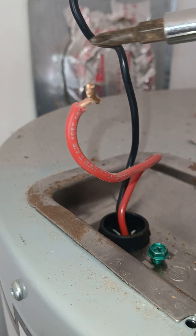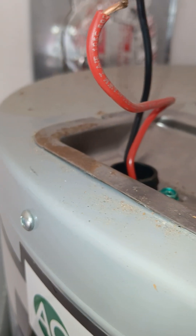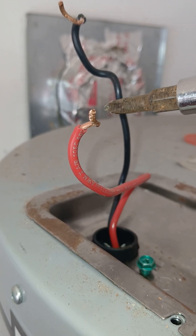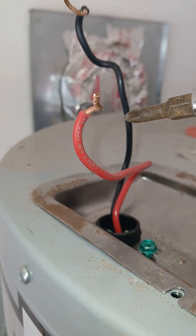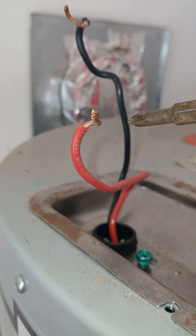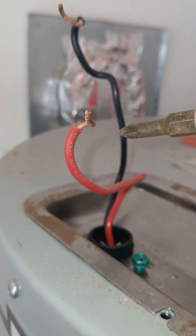They have it wire-nutted here, this is the other half of the plate. I like to take my wires and wind them around each other instead of just putting them adjacent before putting on the wire nuts — I like to make sure I have a good solid connection. And that's how you wire up an electric hot water heater, like a 40 or 50 gallon unit.